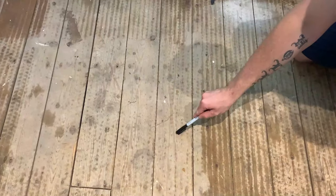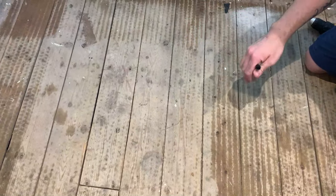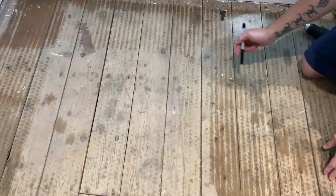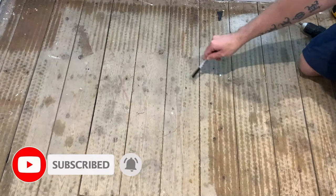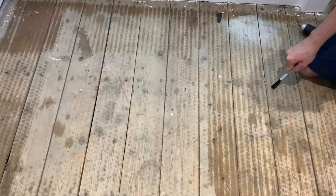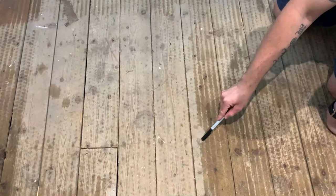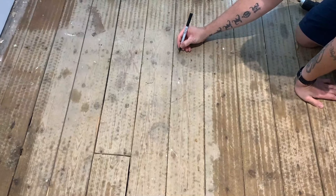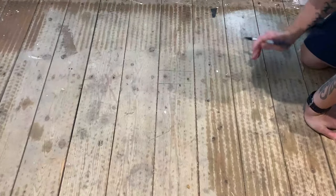I want to take up this floorboard and cut it on a joist so when I put it back down it's supported. If you see those holes there, that's a line of nails indicating a joist running there. Then 16 inches or 400mm there'll be another one — you can just about make out those nail heads, they've got putty over them so they're a bit harder to see. That indicates the two-inch joist will be about there.